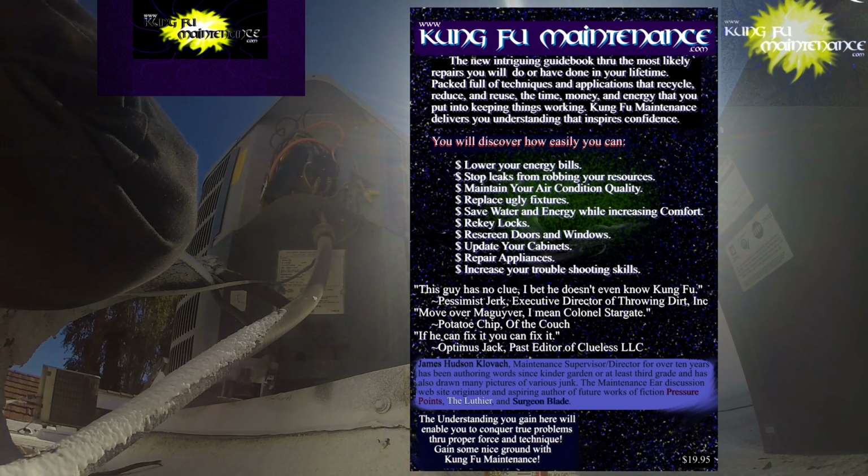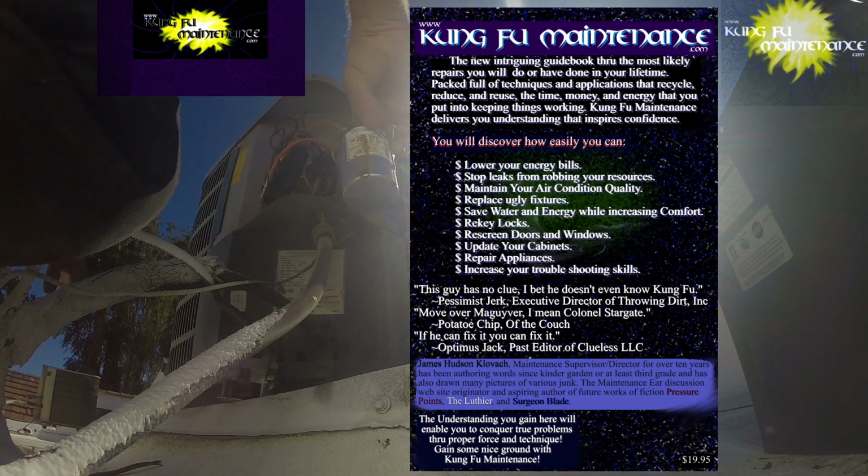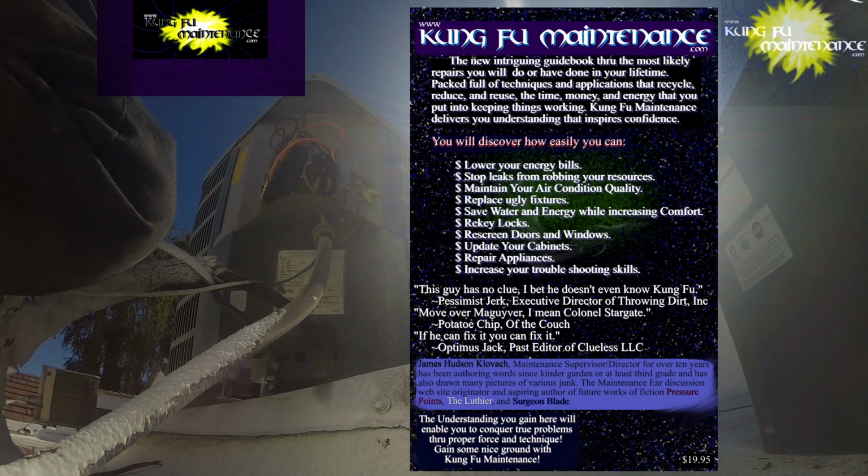So everything was working good before. And our compressor sounds great. Sounds like it's working good. We don't need 2 hard start kits on there. Looks like they had, I believe, the wrong size capacitor, because I've seen a lot of these using 35. So, in the trash, take out the trash.